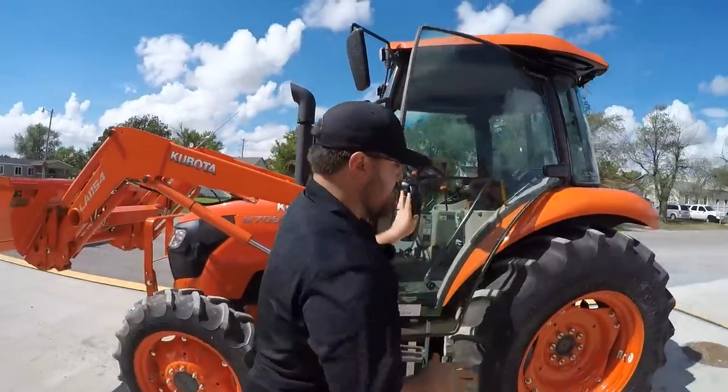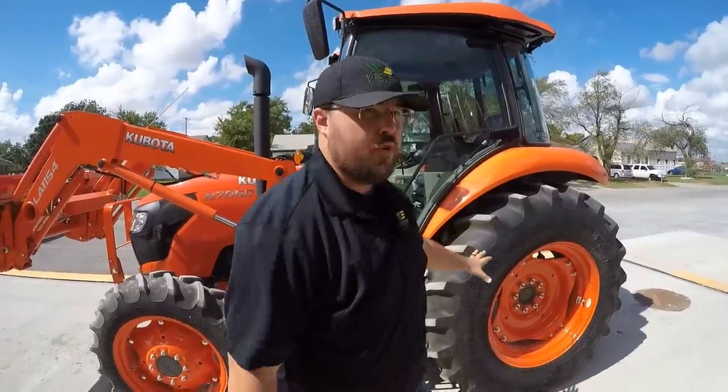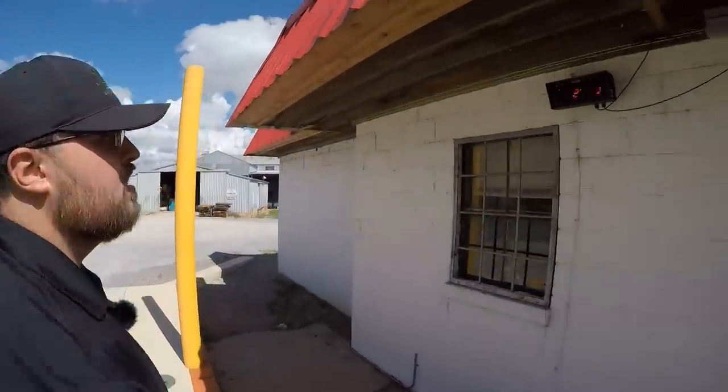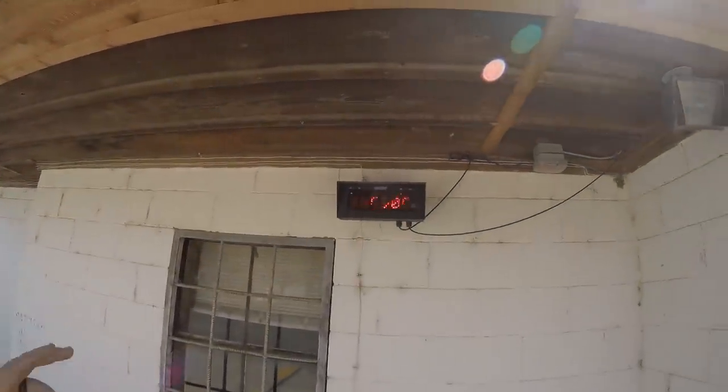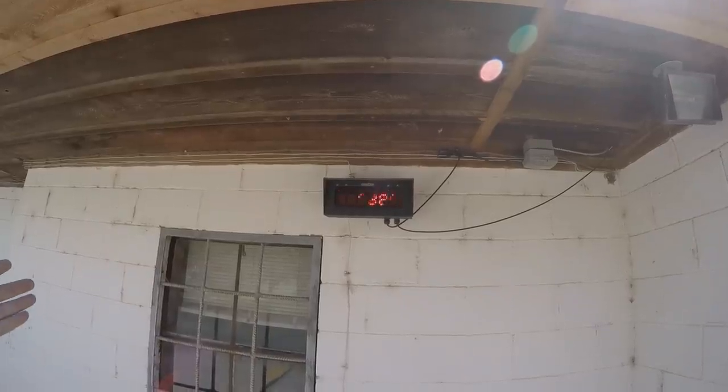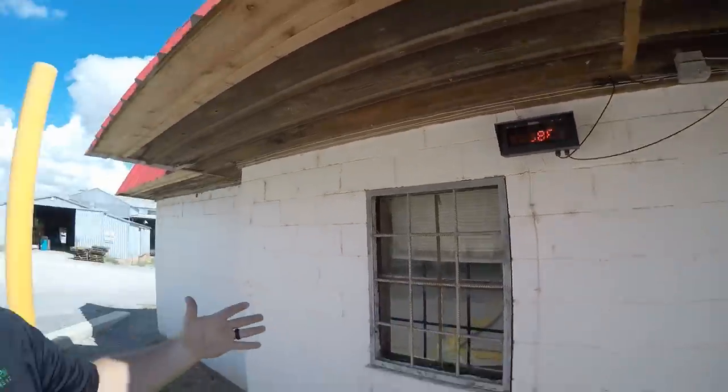With me out of the cab, and knowing there's fluid in the tires, we come over to the scales. You see it's about 8,900 pounds. So we deduct the 1,200 pounds, making it about 7,700 pounds. From here, we'll pull on the John Deere and go through the same thing — check the tires and see how much it weighs.